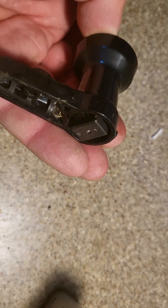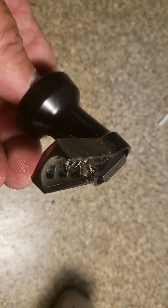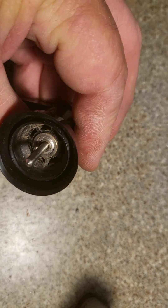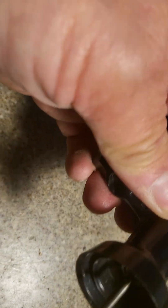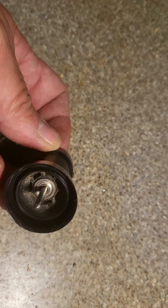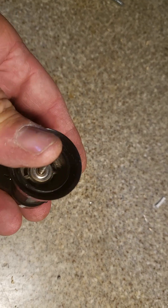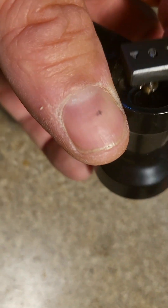So if you're going to be a cheapskate and don't want to replace this — it's actually about 20 bucks, which isn't bad, but still — if you want to extend the life of this, I really think you should be able to do it. It's very smooth now. It's just a little bit of clean and a little bit of oiling, and don't lose your little clip. Even though I think if you lost it, it's no big deal — this would pop up into the anemometer and then your cups would go on here, so it's not like it could come apart. But if I had the clip, I would definitely put it back on. I'm going to hang on to this one in case something happens to the one I replaced, and I might put this one back in its place. But if you want to extend this thing's life a little bit and not spend the 20 bucks on it, you could probably do this and it would last a little bit longer.